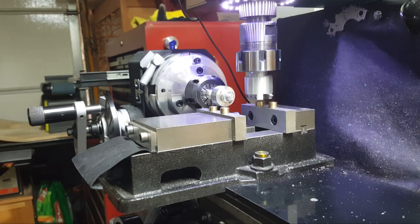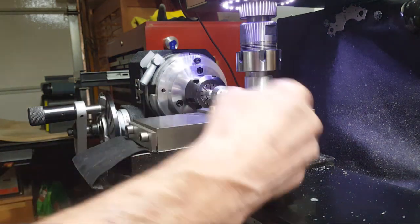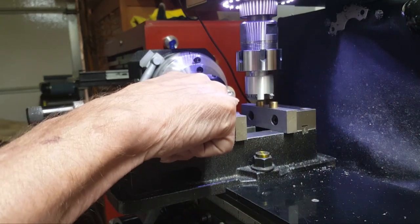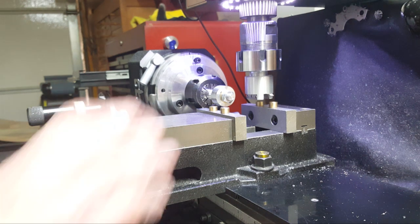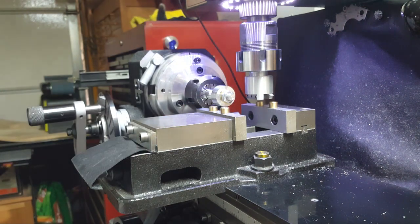For vertical, all you can do is take this and with a magnifying glass guess as to where the center is. I don't think it matters too much being off a few thousandths. I took Y in until I just dusted the surface. According to the print I need to go in thirty-nine thousandths, so I'm going to go in right now.